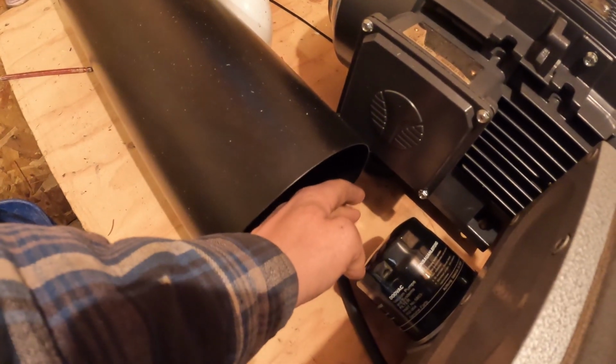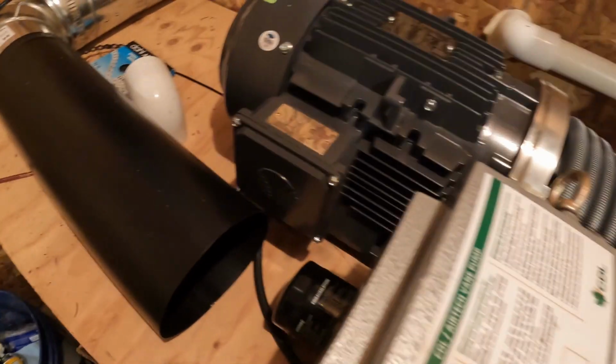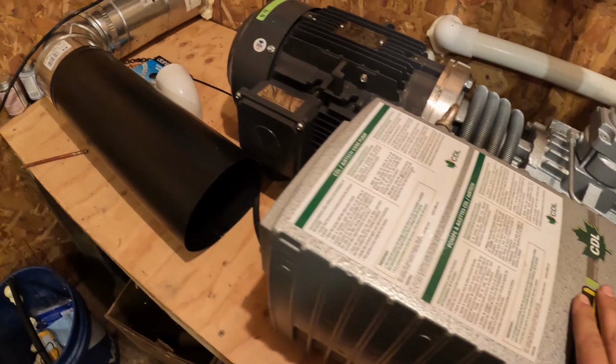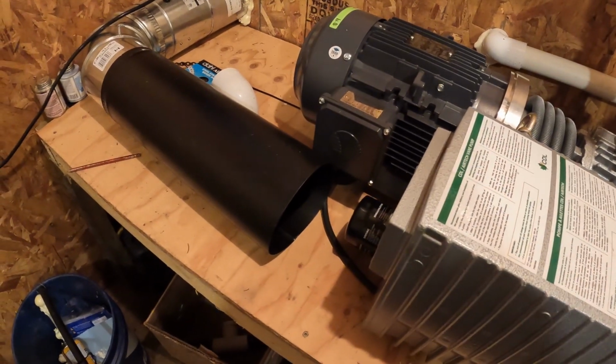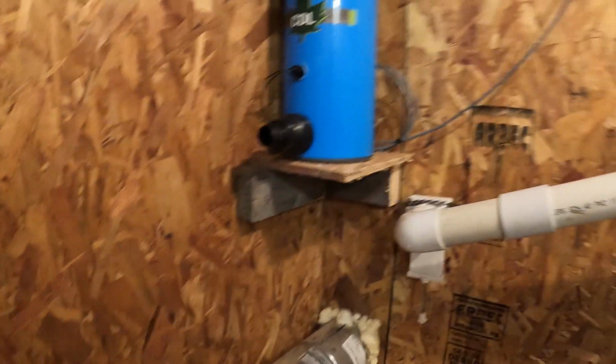This pump is inside the station, which means it's always above 0 degrees when it starts, but when it's not, I like to put a little heat on it to make sure it's a little warm when it comes to start it. The heater is controlled by a thermostat, and the fan to cool down the pump starts as the pump starts, by the same controller.